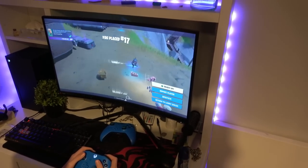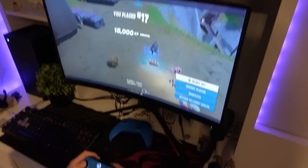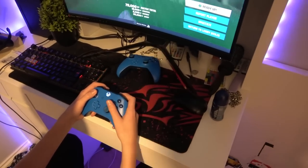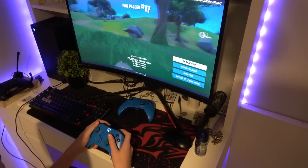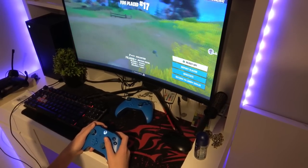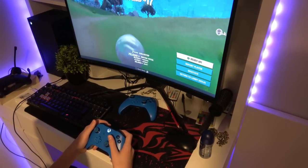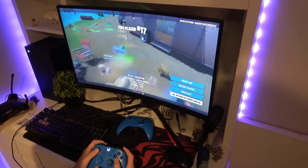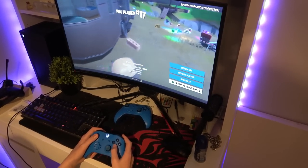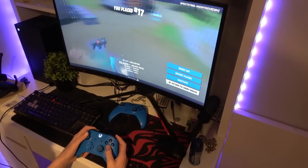Oh, well, there you go, 17th. Not bad, because you didn't play it. Well, there we go. I suppose successful. If it's not, I can always do a revisit video. Really, really strange. But the whole fault there was strange. The chip went in with a short, a 7-ohm short, and then after all that, the resistor completely blown open for the trigger. It's just all very, very strange.